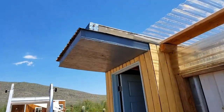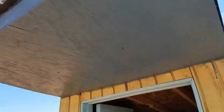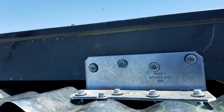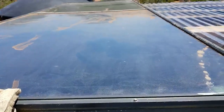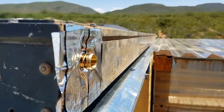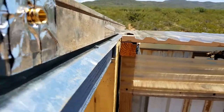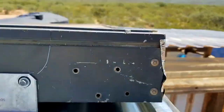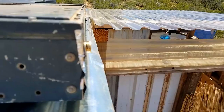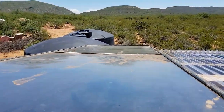Got the water heater done. We just lifted it on the roof, took four of us. Very difficult. It's a solar hot water heater, so there's the little panels inside. I rigged it up with PEX fittings. So basically this PEX will come in and out into the little soffit here. This will be our input, and then down there will be our output. And that will do the shower and the laundry machine.